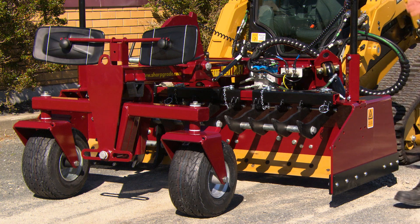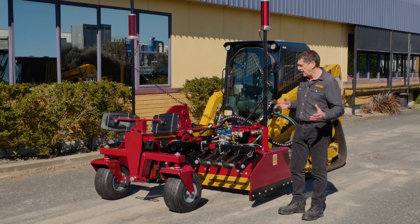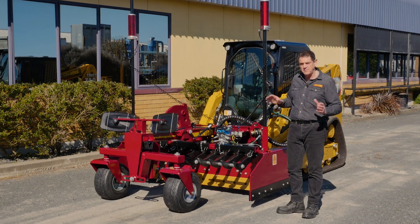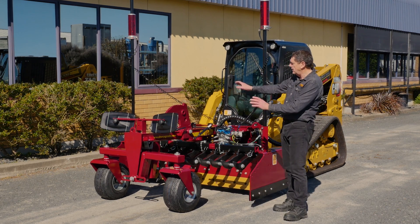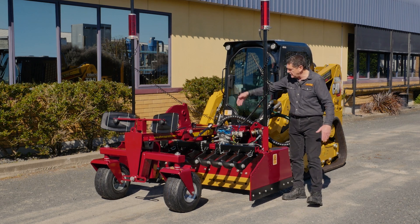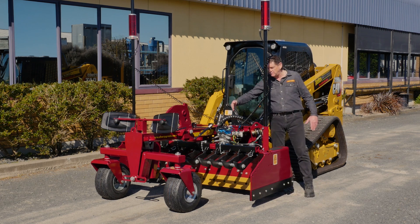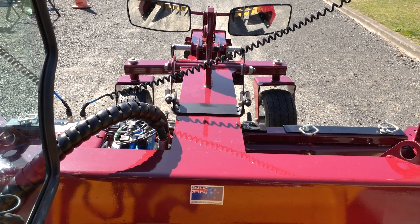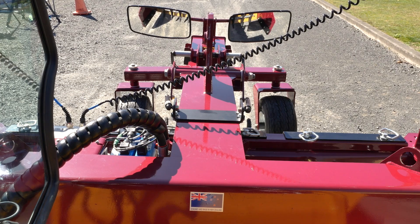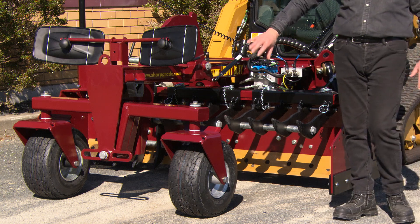This is an evolution — our Mark II. We've been making the previous model for nine years and distilled all of the issues into this model. A lot of things remain the same: the walking beam, the bump stops. We've changed the front from a triangle to a mono beam, which gives you better visibility down into this area when grading — especially on a pad with service pipes. The mirrors are protected by the walking beam itself on this model, so we don't need a separate protector.